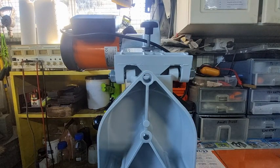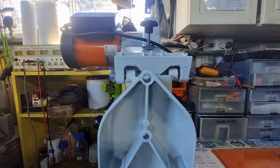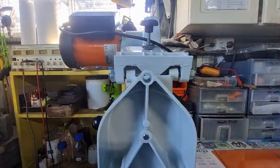Why do we have an offset of three degrees? That had me puzzled for years and it's had a lot of other people puzzled as well. When you have an offset hinge like that — a large gap on one side and a smaller gap on the other — the hinge won't tilt equally. Imagine if a door was offset: if you put six or seven millimeters of packing on the hinge from top to bottom, the door would open crooked. So by offsetting this hinge, it moves differently.